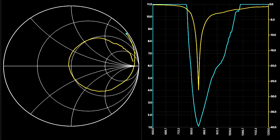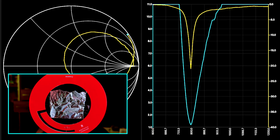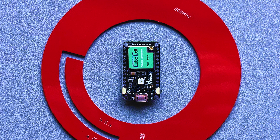You could pack more electronics in. Even a larger piece of aluminum foil is only slightly lowering the resonance frequency. A small board has no effect. With a larger piece of aluminum foil, you are losing about 1 to 2 dB of signal strength due to the resonance shift. However, by tuning the antenna back to exactly 866 MHz resonance, you will get the original performance. So, no problem with the electronics.